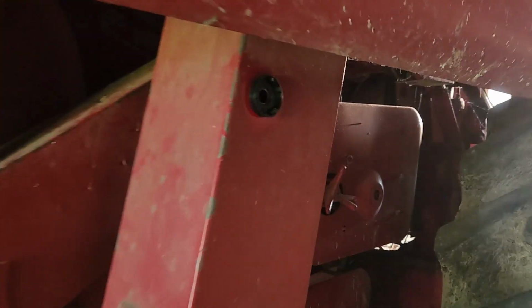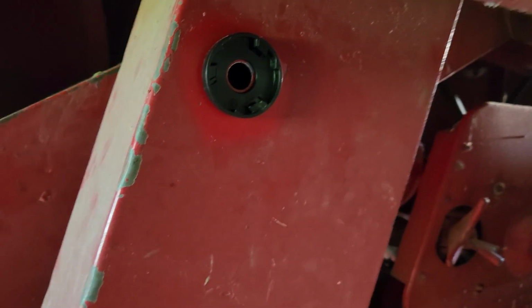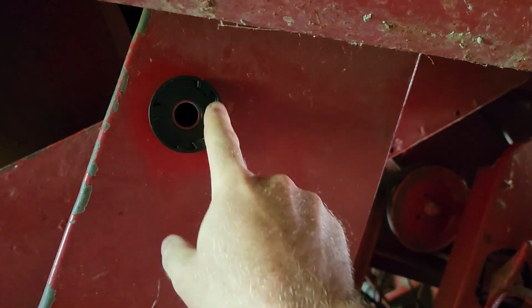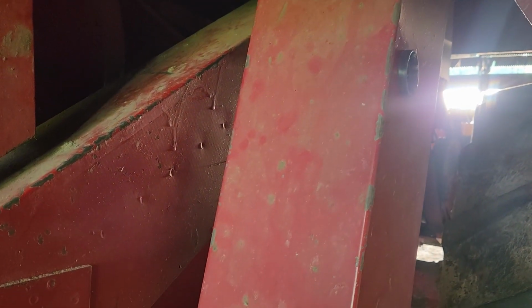Got our holes drilled. You punch this hole first, and then they give you an extended chuck you put on, then you're able to, with a drill guide they call it, reach right through and drill to the other side, so you don't have to worry about turning your drill around to get the back side and the clearance. And there is just enough room on this back side.